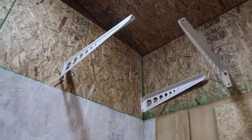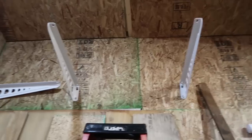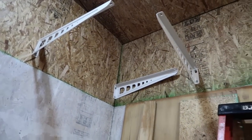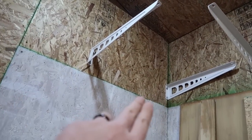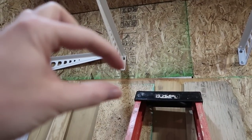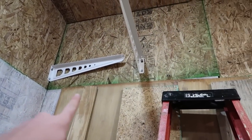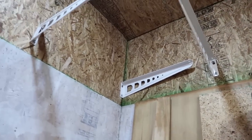That completes the first bracket. I noticed it was a little bit difficult to find the correct height to match these up — I did one side first, then moved to the second one, so I had to find the correct height between them — but after a little bit of work I managed to get all of them set correctly. Take note that I built this building myself and that corner is not perfectly square — it's going to correct itself in just a bit.